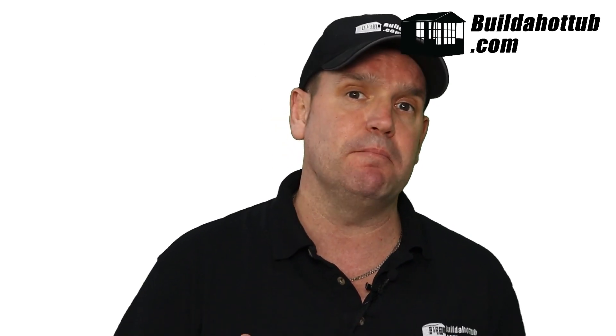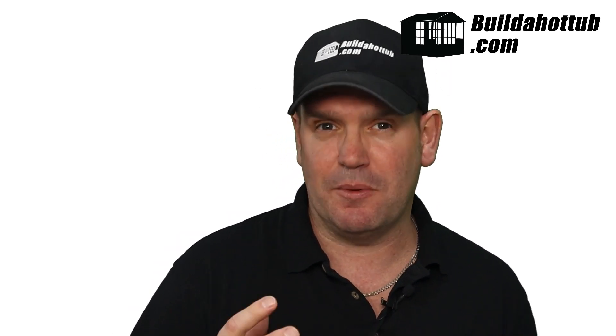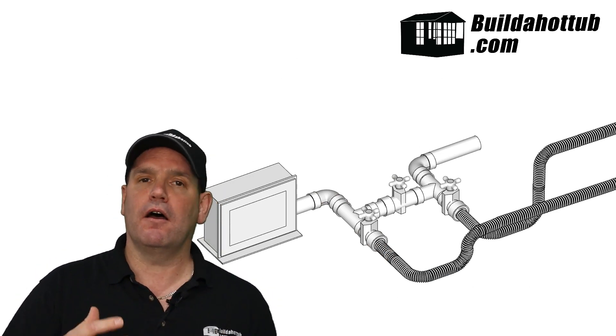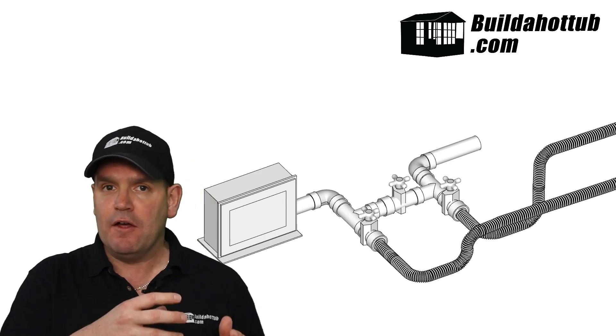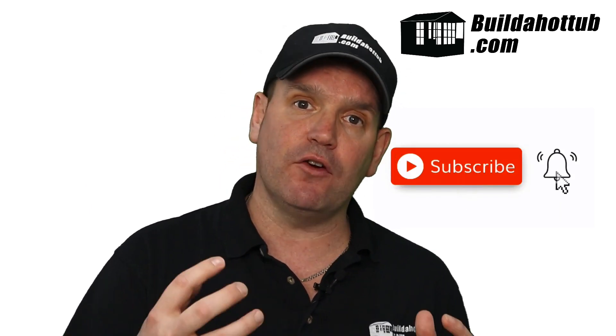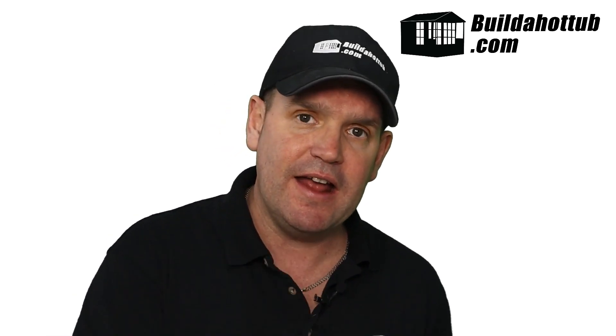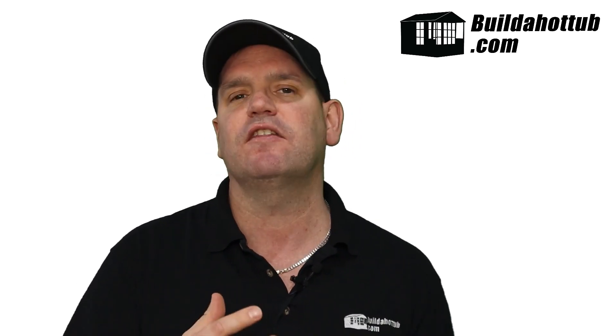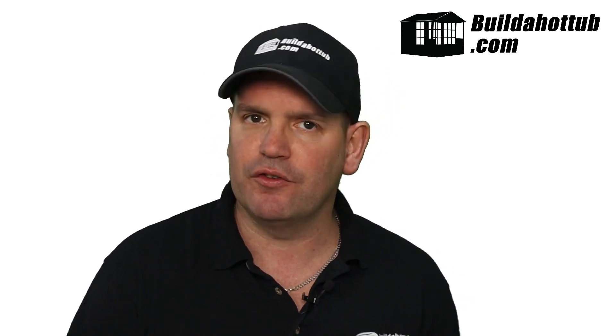When you're connecting an air-source heat pump to your dual-speed pump, the first thing you want to do is find a suitable location to actually cut into the pipe. Ideally, you want the air-source heat pump after the heater on your system. The front of the pump is the suction, so the water is coming from the actual tub itself. Out of the side or the top is the discharge, and from there it's going to go into a filter, into your electrical heater, which we are going to disconnect. And then after that is where you're looking to cut your pipes.